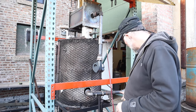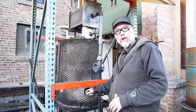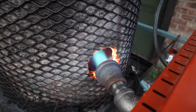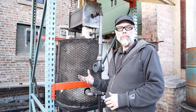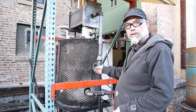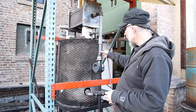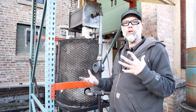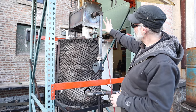The orientation of the burners is pretty straightforward. The main chamber is run off just a single burner — it's the same style of burner I just showed you — and that's also what I'm using for the afterburner. The main chamber burner has a little bit larger reducer to help spread that flame out over more surface area as it projects into the kiln. The squirrel cages I'm using are Dayton — I think they're 60 cubic feet per minute blowers. The nice thing about these is they have shutters on the intakes, so I can adjust and regulate the airflow directly from there as opposed to having an extra ball valve. So I can control the carburation — the mixture of my gas and air ratios. One burner for the main chamber, second burner ultimately for the afterburner.